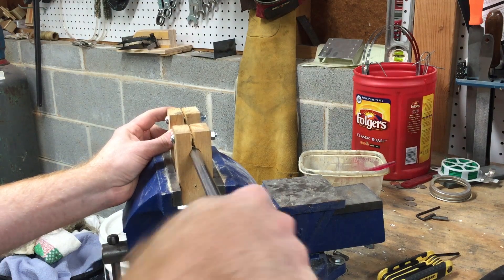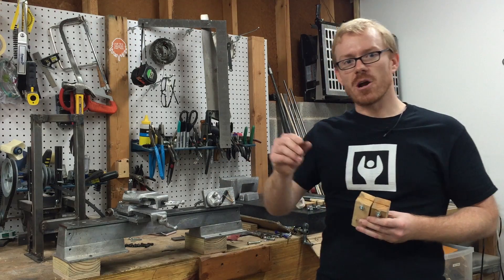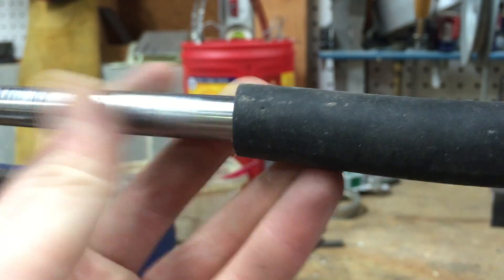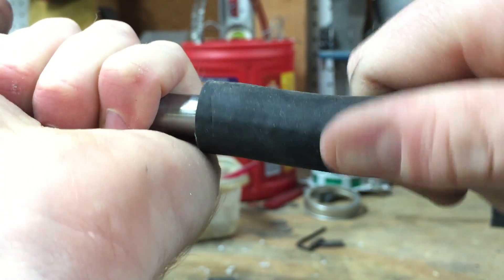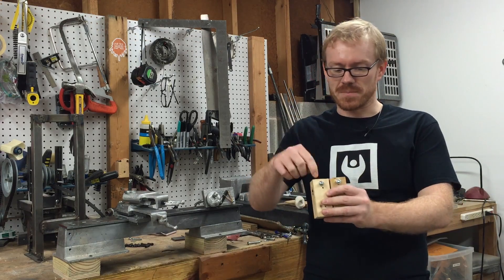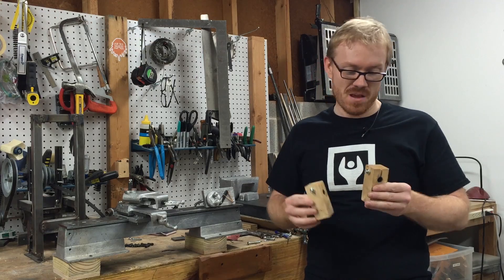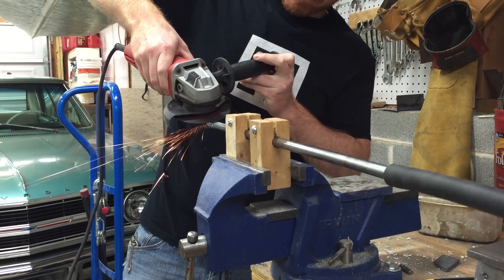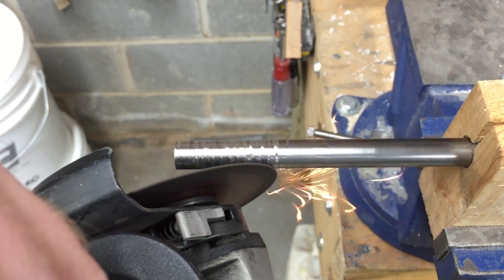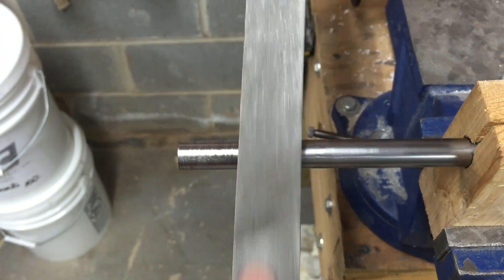I put the tube into these clamps, held them in my vise, and then I used a rubber hose to attach the tube to the motor that I had for this project. I turned on the motor to get the tube spinning, dropped in some oil in the top of these bearings to keep them from getting too hot, and it worked pretty well — they got warm, but it was fine. Then I used a file and angle grinder to help me get that diameter down the handful of thousandths of an inch that I needed.